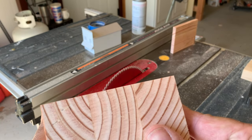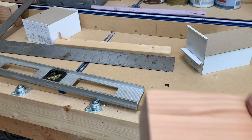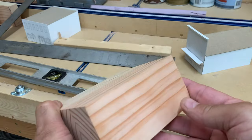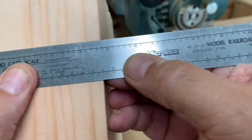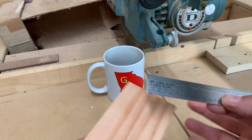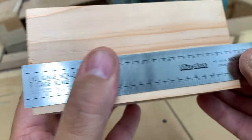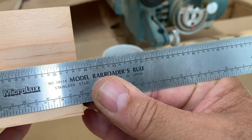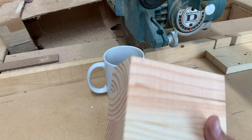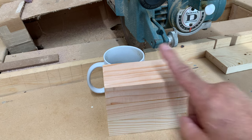There's just a little bit of delamination, so I'm going to run this on the jointer to clean that up. Turned out just pretty darn good. Checking our measurements: we are right at 19 scale feet in width and right at 20 feet in depth — that works. So now the next step is to get the pitch of the roof. We're going to leave it long and high, then cut away what we don't need after we establish the pitch.